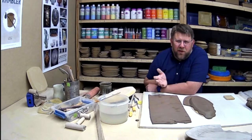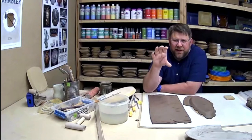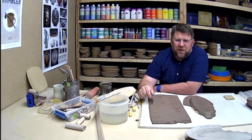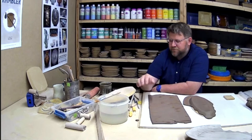You can clean that seam line out, though if you have texture it becomes more time-consuming. You could glue the layers together and route them out, but I'm not willing to do that — I want the product to last without problems from layered glue. Some people suggest painter's tape over the seams, or paper templates for square forms — think outside the box.